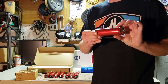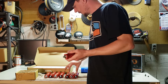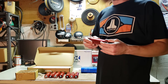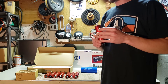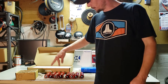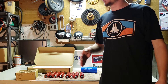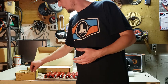A bank of them would be four cells, 8 amp hours, 80 amps of charge. That's a maximum charge, so that's not quite enough to deal with a stock alternator. I recommend a minimum of two banks of these, which gives you 160 amps peak charge. With a stock alternator you'll be fine, but if you have a high output alternator you're going to want more of these.